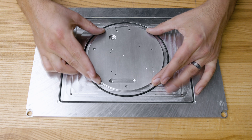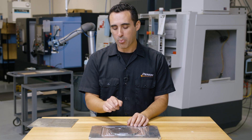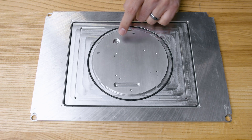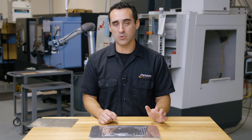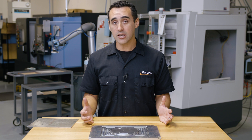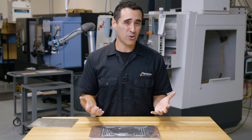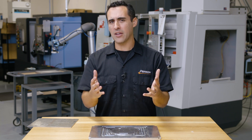The second vacuum work holding area is where the actual part sits. There are plenty of areas that break through this part — the long slot, this larger diameter hole, that one too, and these small 4-40 drilled and tapped holes. If we simply drill through or machine through without isolating those areas, we'll instantly lose vacuum pressure, probably crash, definitely crash and break a tool. And it's just not safe.